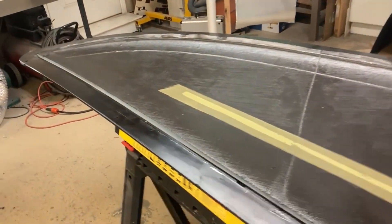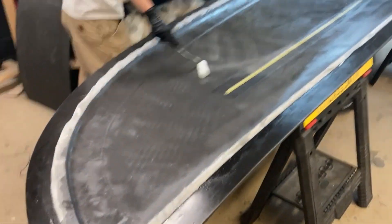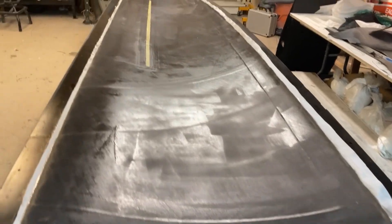First layer is in. Ryan's just finishing up mopping some wet spots — looks like he's done. So we are ready to pull the second layer in. All the plies are on now and peel ply is down. Ryan's just getting the last little bit wet out. You can see the hinge is all done there and captured nicely — nice and straight. Now we're going to spread some plastic over the top of it, then breather and then vacuum bag, and she'll be done.